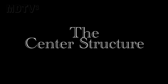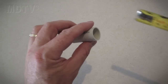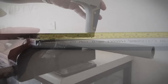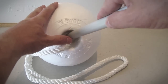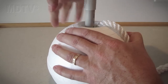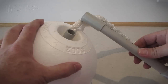Now let's have a look at the centre structure. Measure the length of the inside hole. We're going to add 20mm a side to this measurement so that our PVC pipe fits inside the hole and our joiners fit neatly at the entrance of each side of the hole. Glue one joiner to the end of the PVC pipe, then insert the PVC pipe inside the float. Ideally this will be a nice snug fit. Now you can glue the counterweight to the other end of the PVC pipe.